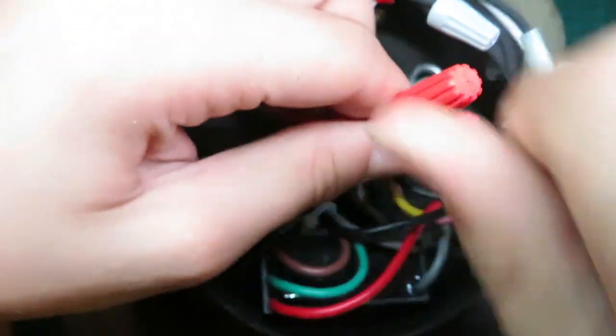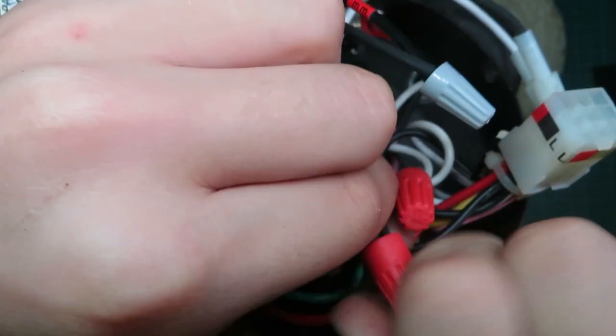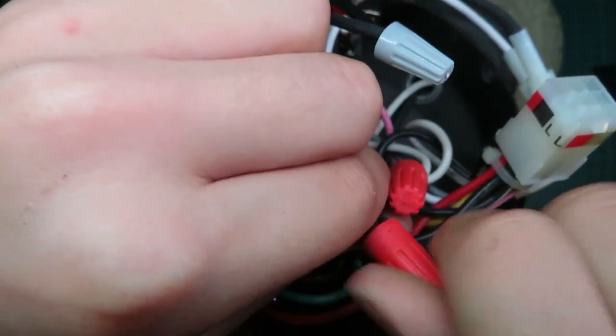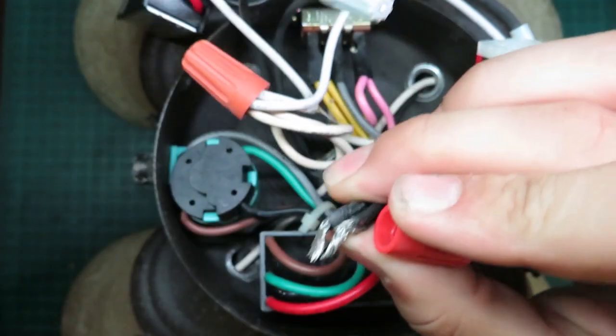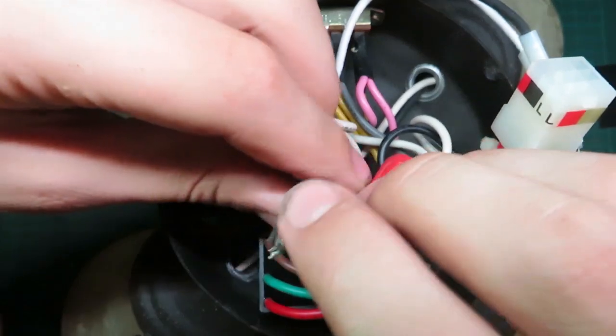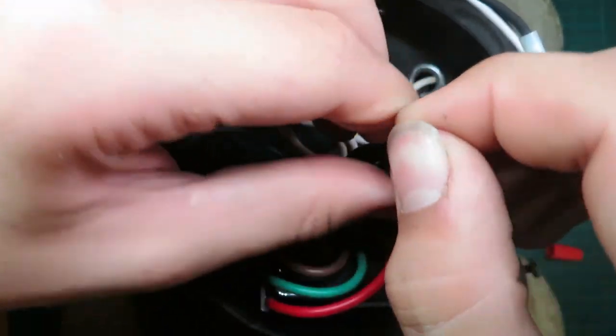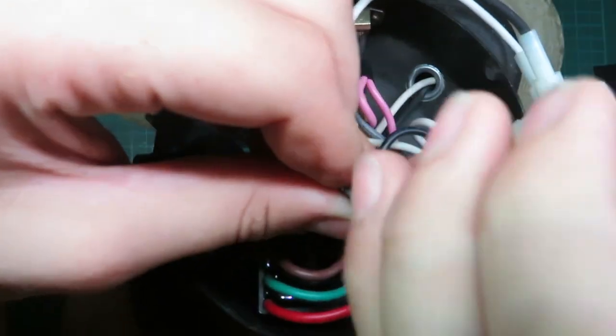What we're doing now is taking the Marette off and we're going to test just the four light bulbs. We're going to disconnect the wattage limiter, hook our wires across the neutral and into the hot for all the light bulbs, then test it and see if it works. The light bulbs might need to be replaced, or it's probably just the wattage limiter.